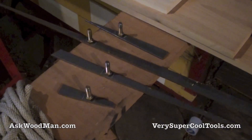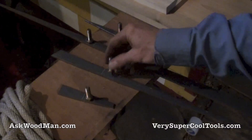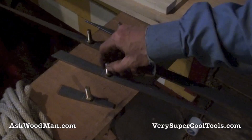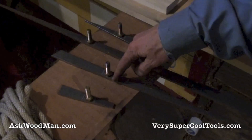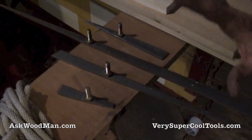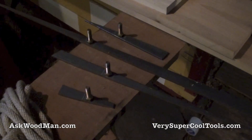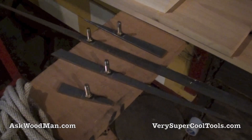The last thing I've got to do is make some handles for these nuts. I just dug in my scrap. I'm going to grind around where I've got these marks, weld this on while I have it, grind the top, bevel it up, get some bright fresh steel. After I get it welded on, I'll cut it here and here — I like to have the handle a little bit bigger. I like to not waste anything. Then I'll just grind and shape these so they're real comfortable, and then I can start using this thing. I'll wait to paint it until I'm painting a bunch of other stuff, but I can use it now.